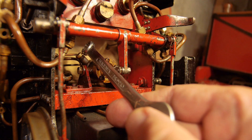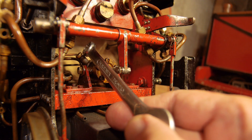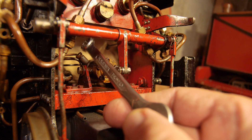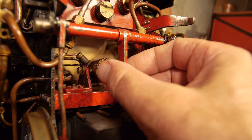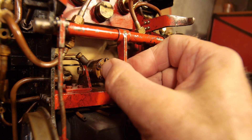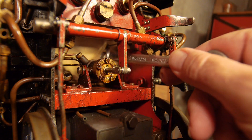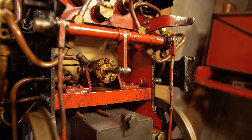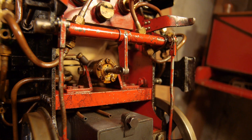This is a steam brake cylinder and the problem lies in this bypass valve here, which allows steam to go through the cylinder to warm it up. Then as the pressure builds up in the cylinder it closes, and the cylinder actuates. The problem is this valve is not closing — it's just a spring-loaded ball valve. So I'm going to remove these two screws, remove the steam supply, and remove the bracket off the bottom here to take the cylinder up on the bench.